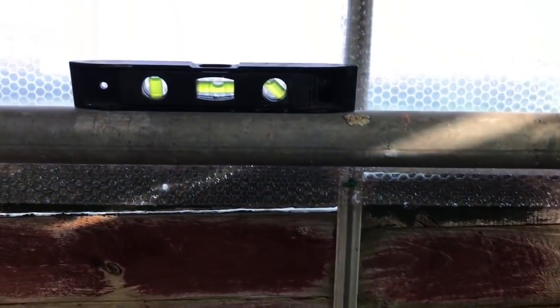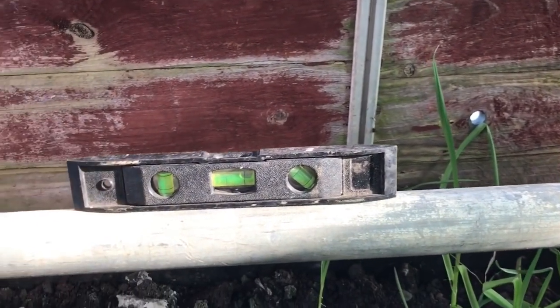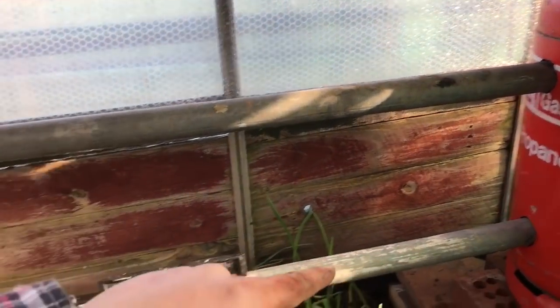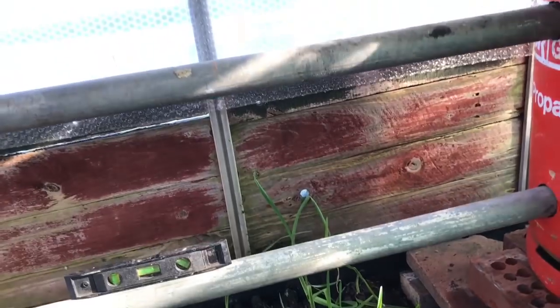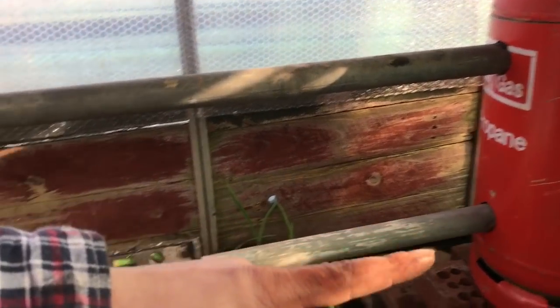So what needs to happen here, it's slightly raised off the floor, so it's not level. Pop that on there. So what the top one is, but the bottom one we've got isn't. This is the hot water, when it heats up, it'll circulate, so it'll go along the top one, along the bottom one, and it'll circulate around and keep the water at a nice temperature. So basically the pipework's going slightly down this way, and it's going down that way, to help it circulate around the tank.